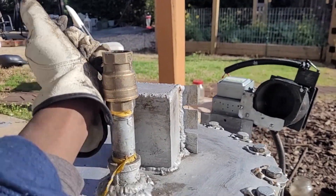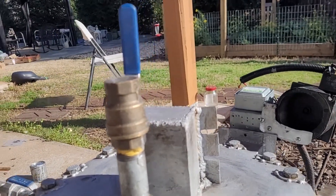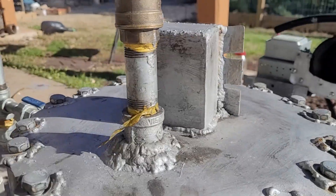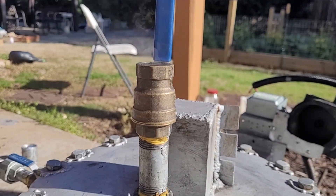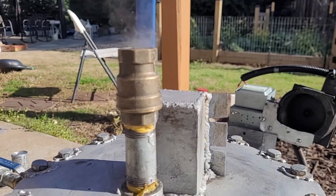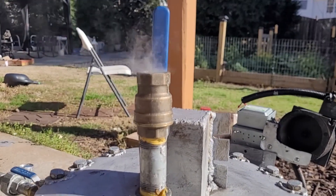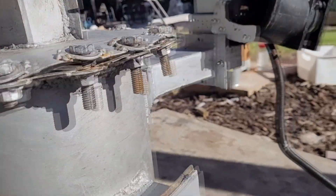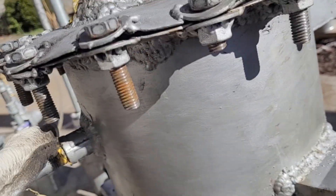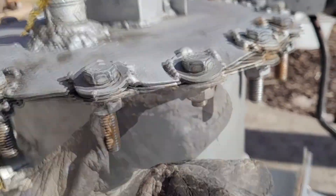She's been running for about five minutes now and something I notice is it's a lot slower. Five minutes in, with the waveguide in the previous position — whether at the top or the side — this thing would be completely pressurized by now, producing that much gas. But now it's kind of slow. I think that's actually a good thing, because it means the heating is more even — it's not just concentrating on one spot. The microwaves come out, hit the wall, bounce around, and absorb into the plastics more broadly.